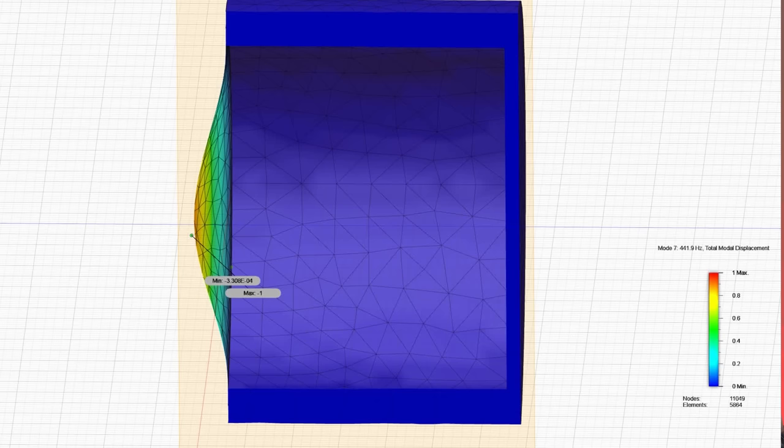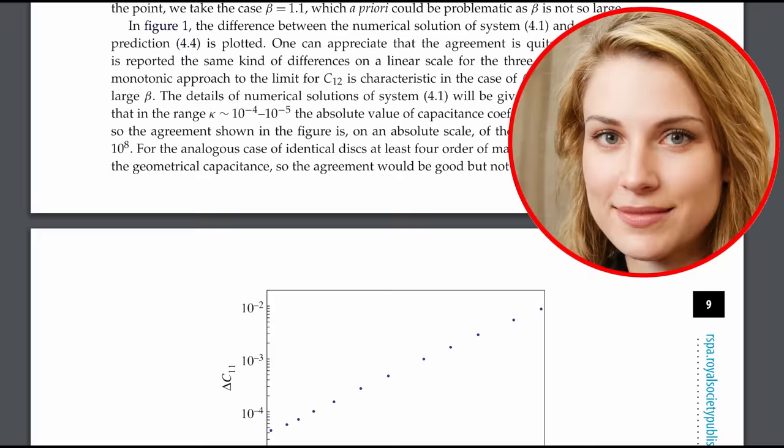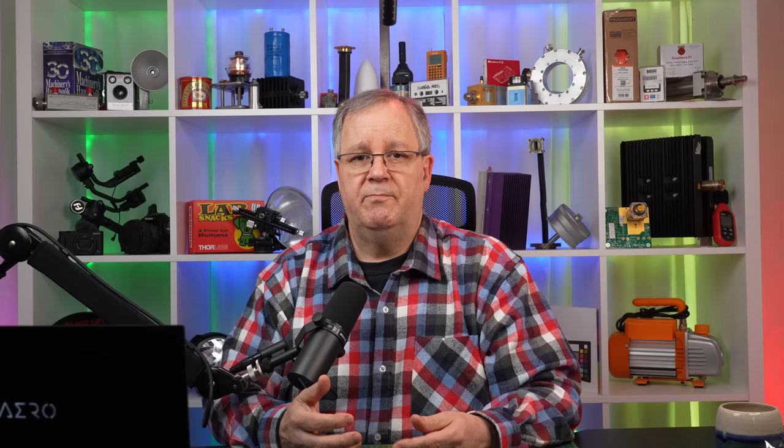So let's think about the movement of the diaphragm. With a 1 kHz signal at 40 dB sound pressure level, the air molecules are moving back and forth with about 10 nm of peak amplitude. The capacitance between the resonator and the diaphragm varies according to the reciprocal of the spacing. With a 25 micrometre gap — that's about 1 thou or 1 mil — and a 6mm diameter post, the capacitance is ε₀ times the area over the spacing. That's only approximately true where the discs are the same size; with a small disc near a large membrane, the analytic solution is much more complex because of asymmetric equipotential lines. As I'd removed almost half of the surface to a depth of half a millimetre, the results probably close at around 7 pF, including some fringing effects.